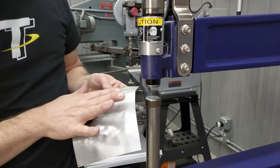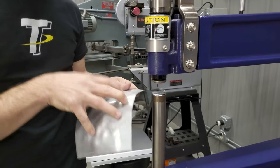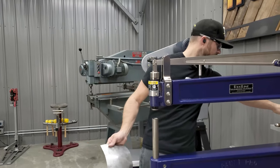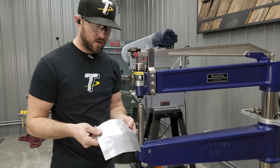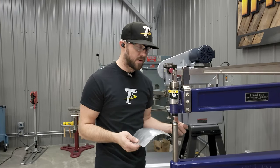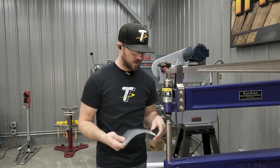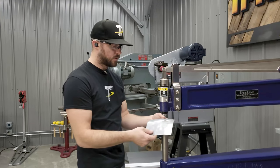You can see that just with that little bit of hammering, this whole area in the center is a lot more smooth than when I started. This is taking a part that already had some rough shape and trying to smooth it out. But if I wanted to, I could replace this lower die with something a lot more aggressive to create a lot more dome in this same area — you'll actually start to see a line around it, creating more of a blister in the part. That's the cool thing about a planishing hammer if you want to add a blister shape to create clearance.